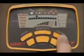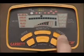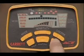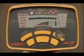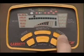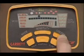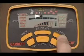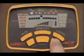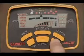Through use of the discrimination and elimination touchpads, specific notches can be created by adding or removing targets from acceptance in any operating mode. There are two methods of setting discrimination notches. You can use the discrimination touchpad to move the cursor and darken the specific segment of the upper scale corresponding to the particular target to be detected or ignored.